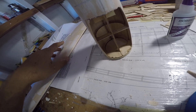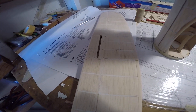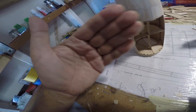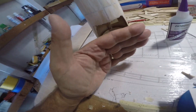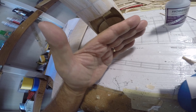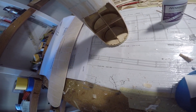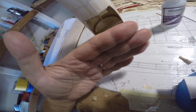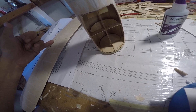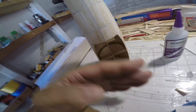That's going to be tricky with the wing installed and the landing gear wires sticking through. We have to get the landing gear bent, situated, and installed - it's a modular component. I'll probably do that after the wing is in the fuselage. The reason is that once the wing is squared to the fuselage body, I can look at the landing gear and make sure it's square too. If I install the landing gear first and then put the wing on, one or the other might not be square. So I'll get the wing in and confirm it's square to the fuselage, then fabricate and fit the landing gear modular component.